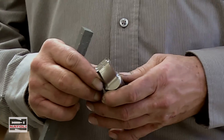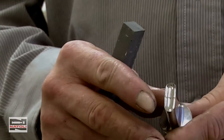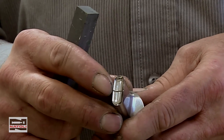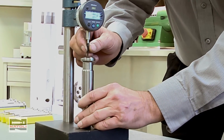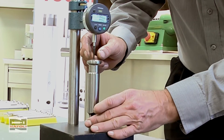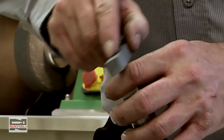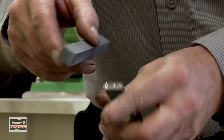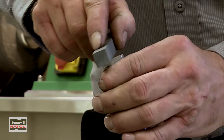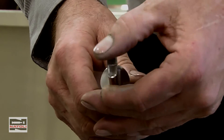Now to refurbish the land on a tool — to strengthen the tip and give it more life — we're going to use a 400 grit stone. As you can see, this tool's edge is very sharp. What can happen is the tool can start chipping, just from wear. So we'll go ahead and measure the tool, zero it out, and take the 400 grit stone to refurbish the edge and cup of the tool with a light stoning. This strengthens the tool. As you can see, there's now a flat all the way around the edge.